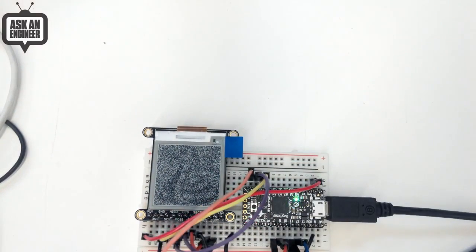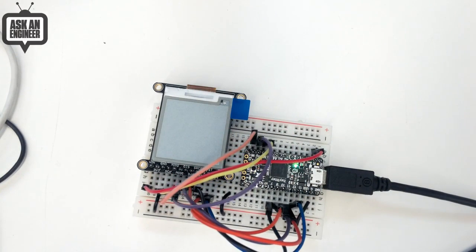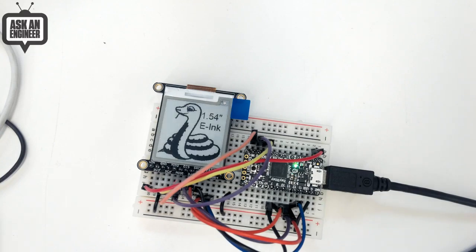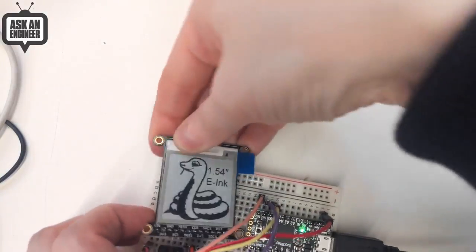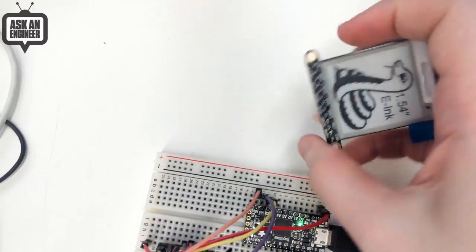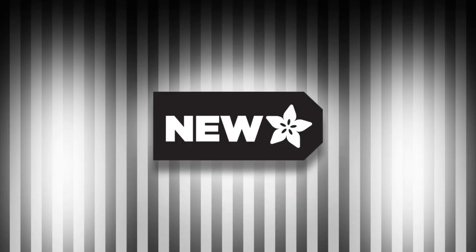One of the things I like as someone who gets to test these is when we use CircuitPython, it just shows up as a USB drive and you just drag your images over, which is way better than all the other ways of doing e-ink. You can display bitmaps — you have bitmap code. And we'll be working on adding full font support. In Arduino, it's supported by GFX, which has a bunch of fonts. So there you go — if you unplug it fast enough, it stays on. It's bi-stable. Pretty cool. Low power, but monochromatic.